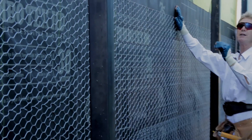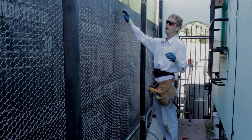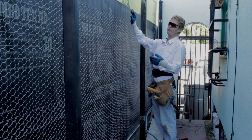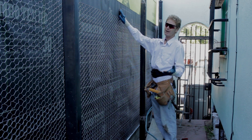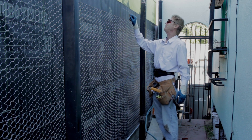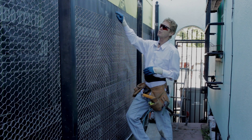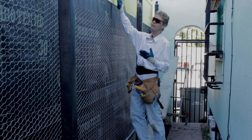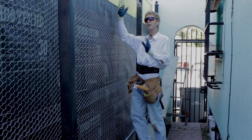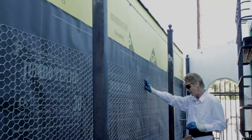Dens Glass sheeting is usually necessary if the house is within three feet of a property in some cities. They've got Dens Glass over plywood here, and we handle Dens Glass just like it's plywood — we put two layers of paper and staple into the studs. This is Dens Glass: it's an acrylic waterproof sheeting on the exterior, and on the inside it resists mold and gives you an extra fire rating.